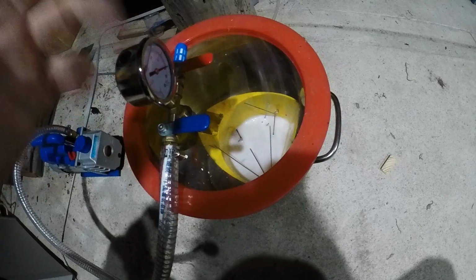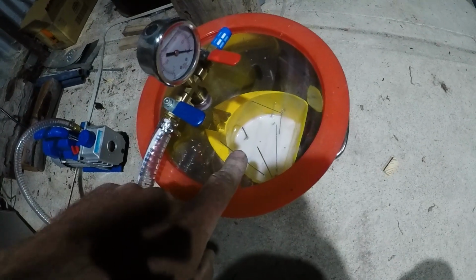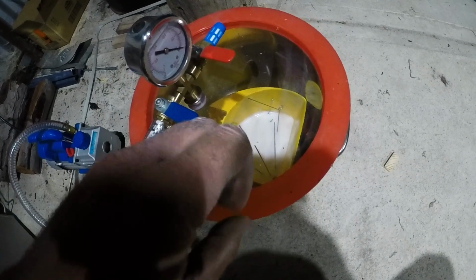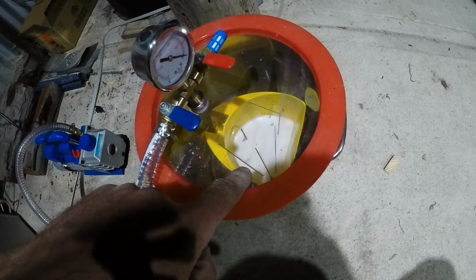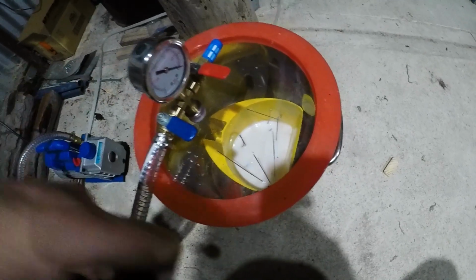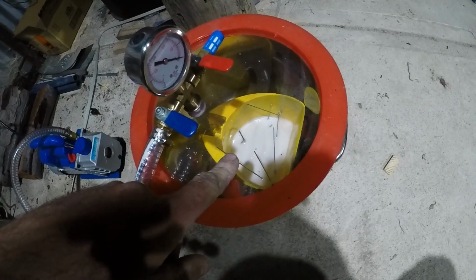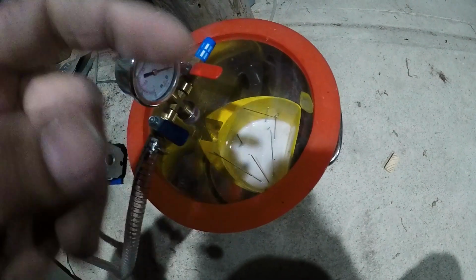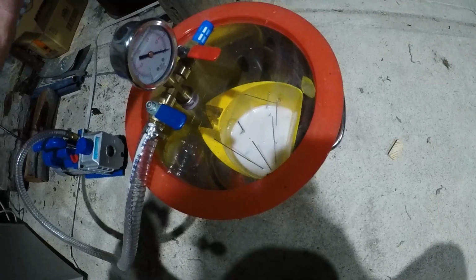Where something is removed, something will replace it. So because the timber's submerged in polyurethane, the air is drawn out of the timber, and polyurethane is drawn into the timber. And what that does is it not only seals it, like if I pulled it out now, that timber would be sealed. It penetrates the grain and seals right through the grain, strengthens the wood, makes it denser, makes it sink, which are all things that we want for this lure. So I'm going to do that right now.